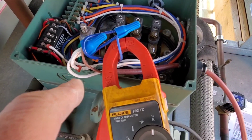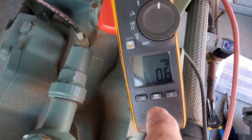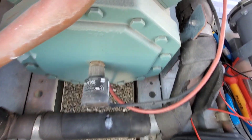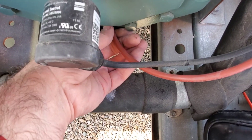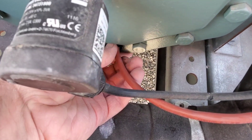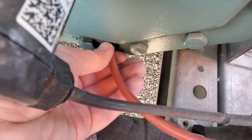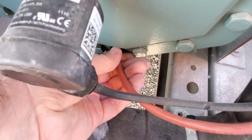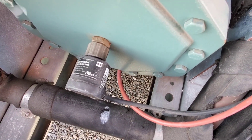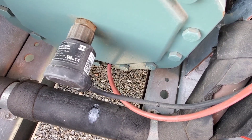The new heater is installed and wired into the compressor terminal, and we are drawing 0.6 amps, so the heater is working the way it should. I don't have my thermal gun up here, but you can feel a bit of a temperature difference where the heater inserts into the compressor. We need to let this run for a bit to warm up the oil and boil off any liquid refrigerant that might be in the oil before we attempt to run this machine.